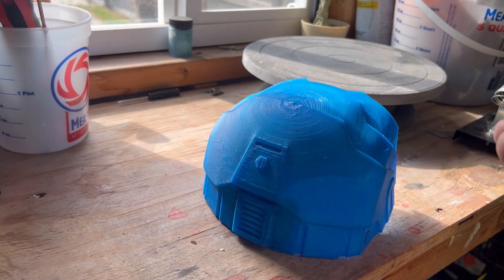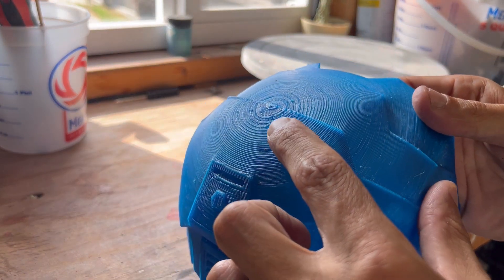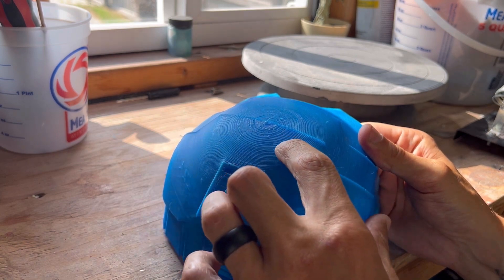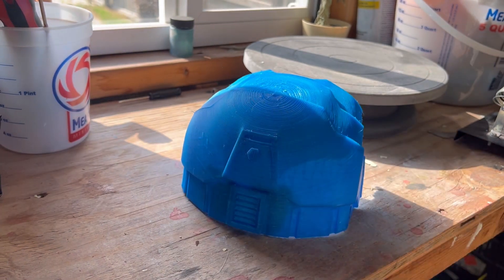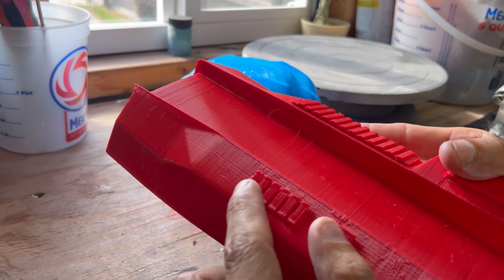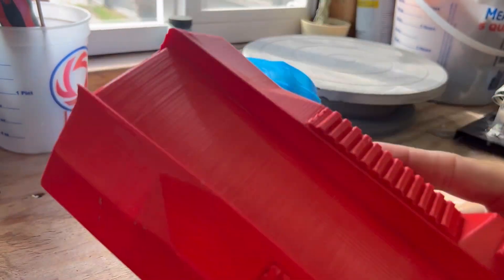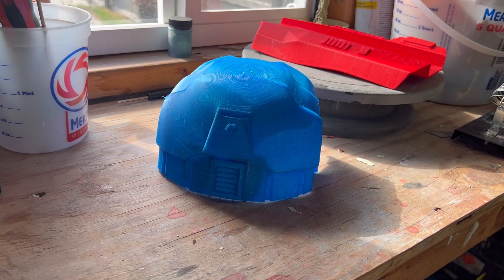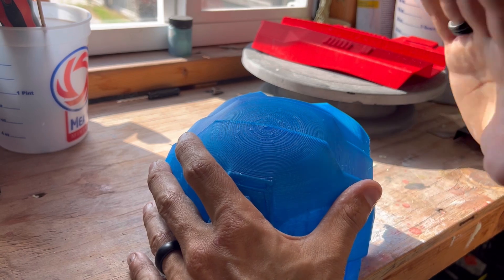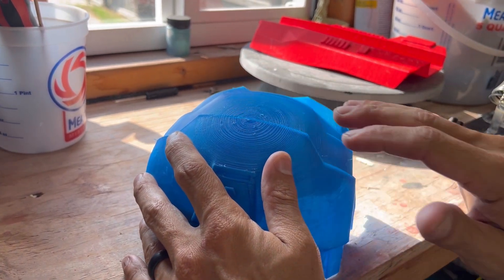This is very common depending on the position of your piece — you get that stepping, especially if you're using a higher layer height. As that layer height increases you're going to get more of a stepping effect. I also use this a lot on pieces with overhangs that get all mangled depending on how they're positioned. This trick with the soldering iron is really going to help you speed up your post-processing. This is PETG, so it definitely takes a lot more effort to sand.